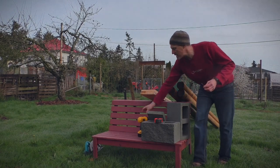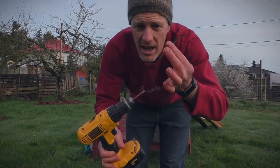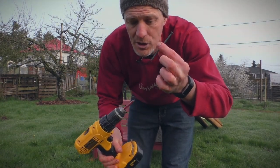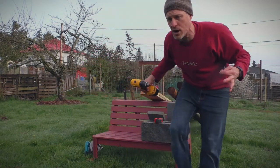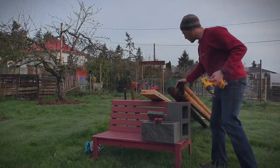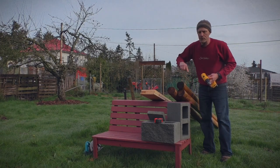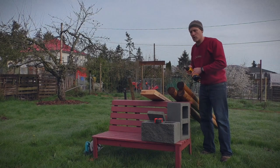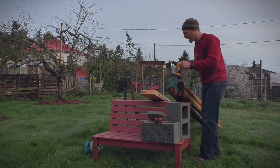To put these together I'll use a bigger screw — about a three-and-a-half to four-inch screw — going in on the sides, not straight down, so it'll be a really strong rectangular box. If you want to go three high with landscape ties, the price I paid ended up being about three dollars per foot around, so a 34-foot box comes in at around a hundred bucks.